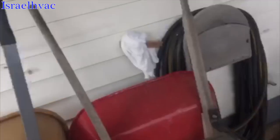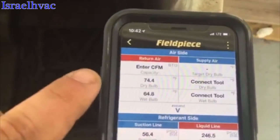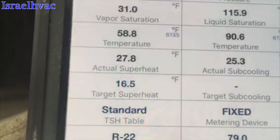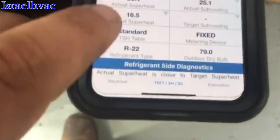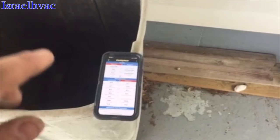Now I'm checking out the Frigidaire and using the app to just about its full effect. I didn't put my supply air probe in because she's just looking for a patch — a gas and go on both units. But I did go stick the return air probe in. You can see my dry bulb and my wet bulb. You enter in your outdoor ambient, which is 79 here, and there you go — your target superheat is 16.5. It changes in real time as the temperatures inside change, but outdoor ambient stays the same. That sensor is a good ways away; you would not be able to obtain this range with Testo smart probes.